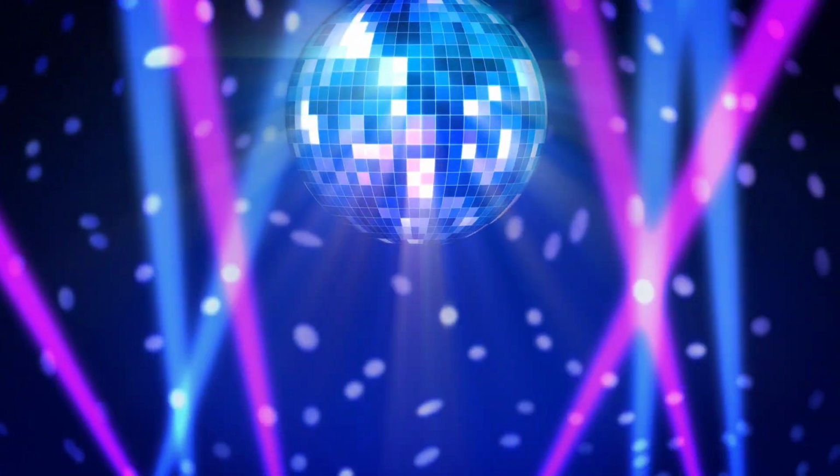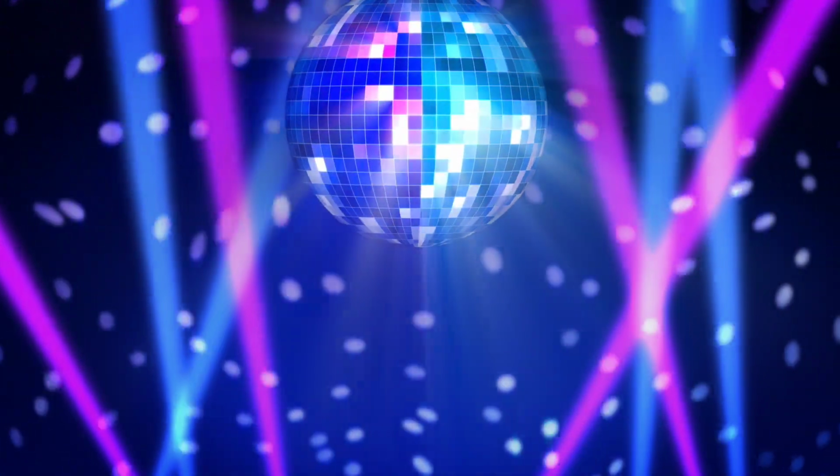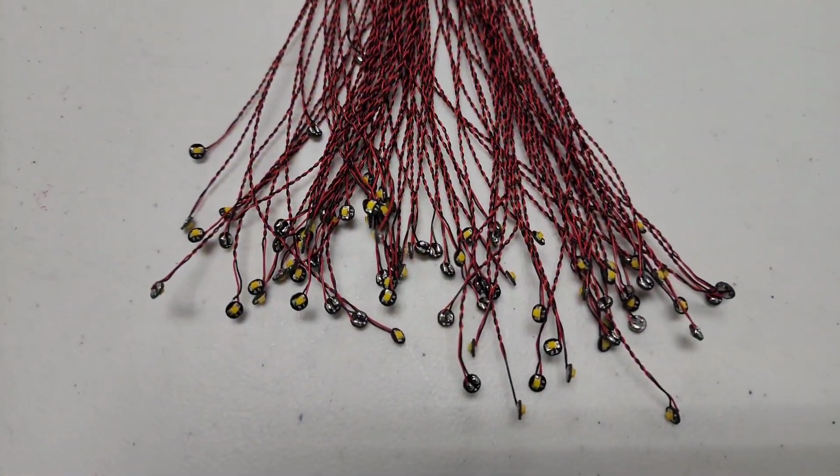Every company, I always tell people it's a general rule of thumb. Most of the lighting companies, they do what I consider to be over illumination on a lot of their light sets. And typically you're going to find that there's at least 20 LEDs in any one kit. So if I was to give you generic information to try and answer that question, I would say no more than 5 kits on one USB plug.